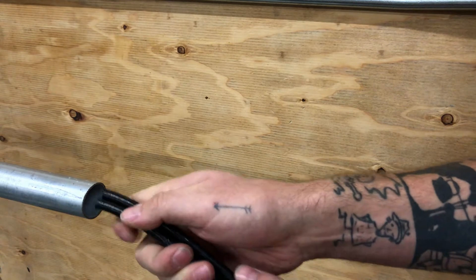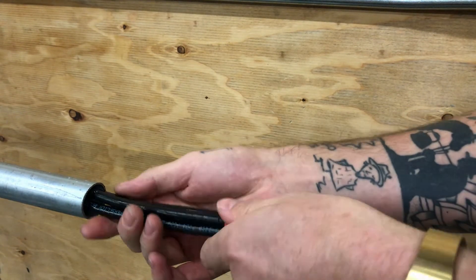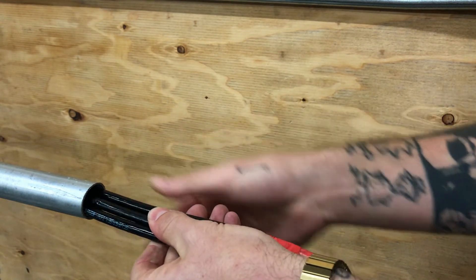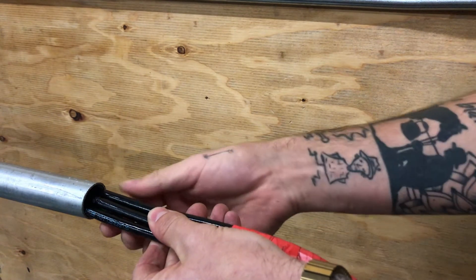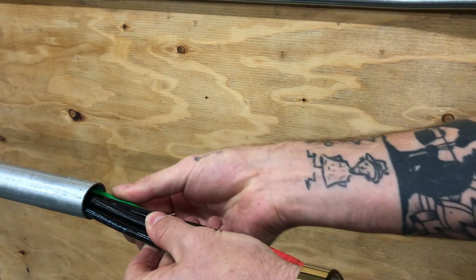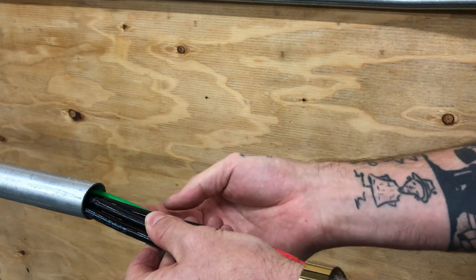The reason for this is if you're pushing wires in a fairly tight conduit, if you let them cross over, what happens is they actually all expand side by side during the crossover. You can see if you have them all side by side while they're crossing over, you're now wall to wall in that conduit.